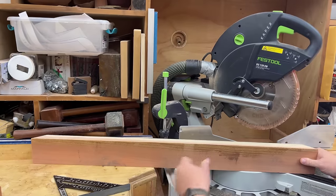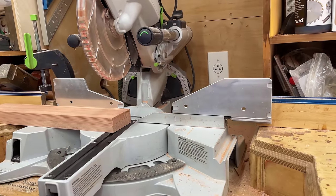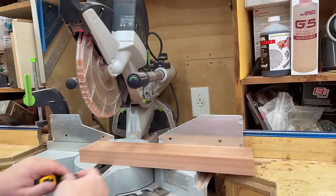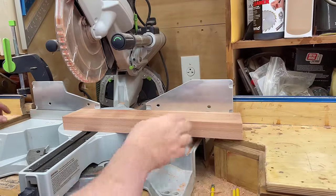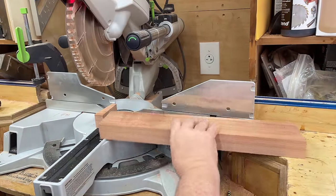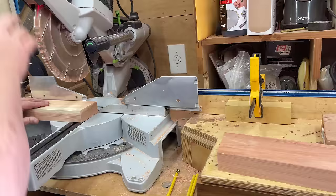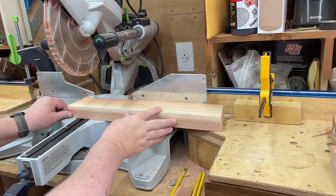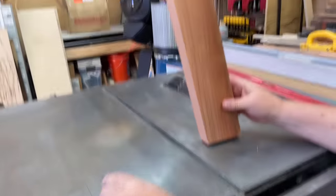After that, we're going to move to the legs. Legs have a miter cut on the bottom and on the top — the same on both ends. I'm going to cut the bottom off first since this board is a little longer than what we need, then take a measurement and get it to the perfect length. It's not critical if this length is exact — what matters is that all four legs are the same length. By putting that miter, the legs are going to splay out. I've got a stop block installed after checking it with my template piece, so I'll cut the miter then slide the board down — don't flip it, just slide it — and cut the other miter. I'll move through all of the legs that way for both tables.